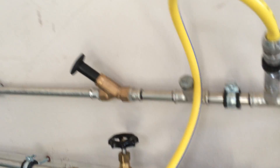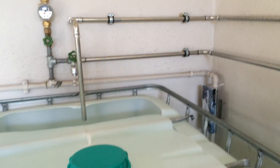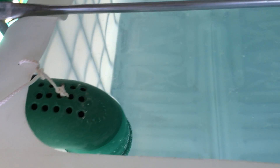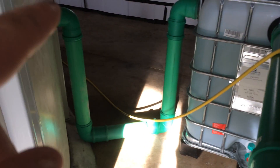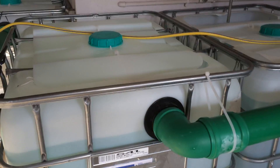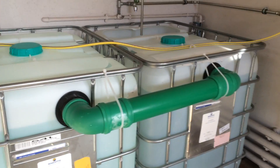The water runs into the first tank, comes out through a solids lifting overflow into the next tank, then through another solids lifting overflow and into the biofilter. We use about 6,000 litres a day — at the moment not very much because the water is still clean. The drum filter only works once or twice a day.